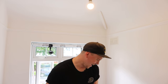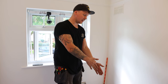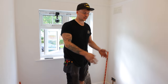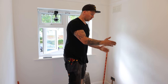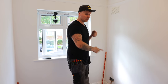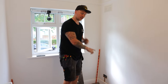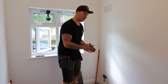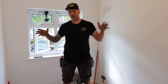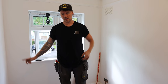That worked well. So what we're gonna do, socket-wise, is our run's coming up here. This is upside down, just go with it. Everyone that does this will know what it's like. We're gonna do it methodically. From here, we're gonna go across to this one, return it back to the nearest one, near the outlet, because normally you would see, it's in there, you go here. Up here, return back, go in here, then we're gonna get the lighting done below, which is in the two-way switching for the landing, and you've got this light.